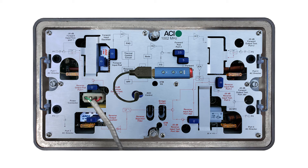When the alignment is finished, the controller will flash blue on and off rapidly, indicating that the DSIM is now in AGC mode. Remove the controller from the cable, then remove the cable from the DSIM, and the amp setup is complete.